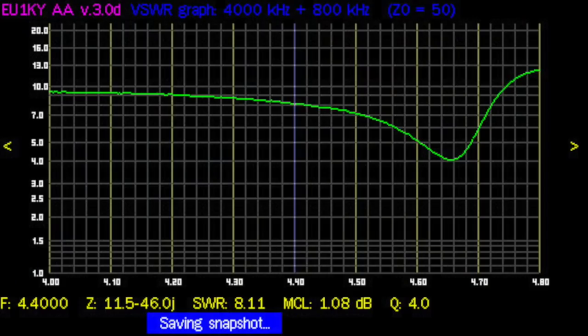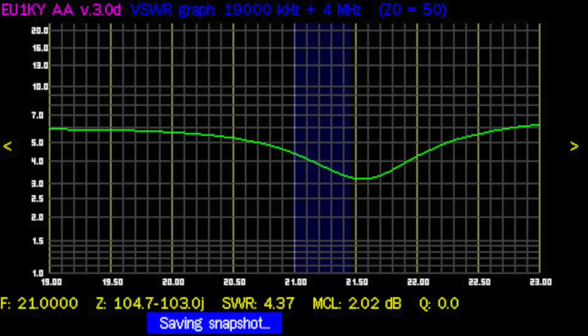I just listen to the hiss and when I get the maximum hiss, I get the lower SWR. I'm very happy that it covers 20, 30, and 40 meters, although not as well on 20 and 40 — especially 40 — but it's optimized for 30 meters, 10 megahertz. What's a bit unlucky is that propagation is not very good today. The capacitor can lower the frequency to about 4.65 megahertz, so it could be used on 60 meters, but with that number of turns on the toroid it clearly doesn't work, and honestly the efficiency would be just a few percent.